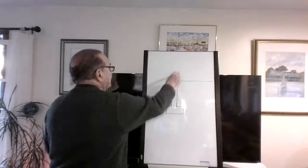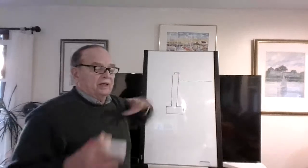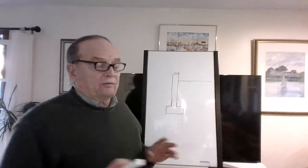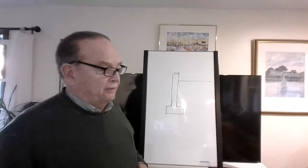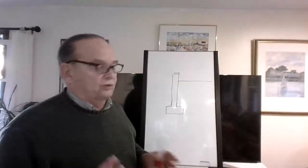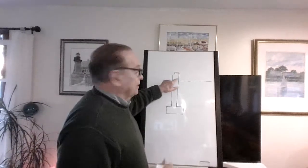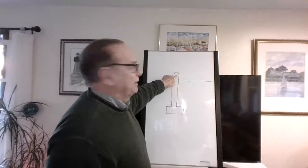Okay, not our concern. They put the sill down, but you got to understand how this goes. The sill goes down like this here. Now, on a very old house, the sill used to be solid wood. I lived in a house with that. It was like 6 or so by 6, and it was full size lumber, unlike today. So this is a 2 by 6, really inch and a half by 5.5.